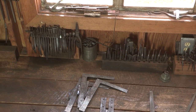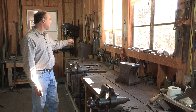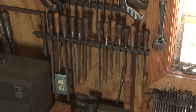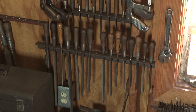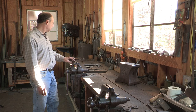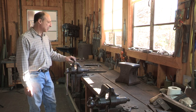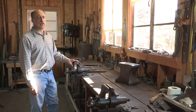I also have pliers, compasses, rules, and of course files — files are the tool I use at the bench most often. They should be stored so that they don't touch each other, which is one reason I like a wooden bench: the files can rest against the bench top without being dulled or degraded. File storage in my shop is open like this, but files stored in a drawer or cabinet would work well too, as long as they're not stacked on top of each other. This bench is 12 feet long and about 30 inches deep. That concludes my quick shop and bench tour — thanks for coming to take a look.